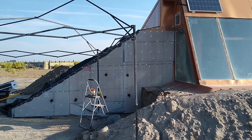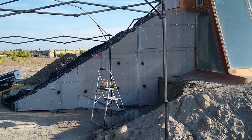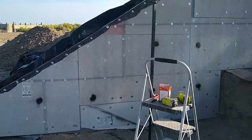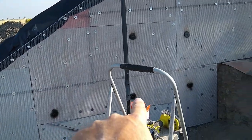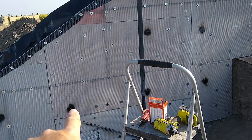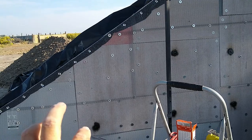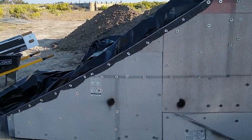Working on this west side wing wall — I'm doing this differently from the other side. We've got the OSB on, the cement board on, it's all screwed together and screwed to the tire bales. We've got rebar anchors into the tire bales several inches each — one, two, three, four, five, six. Those washers are welded on and they're going to keep the wall from coming out this way, giving it extra support.